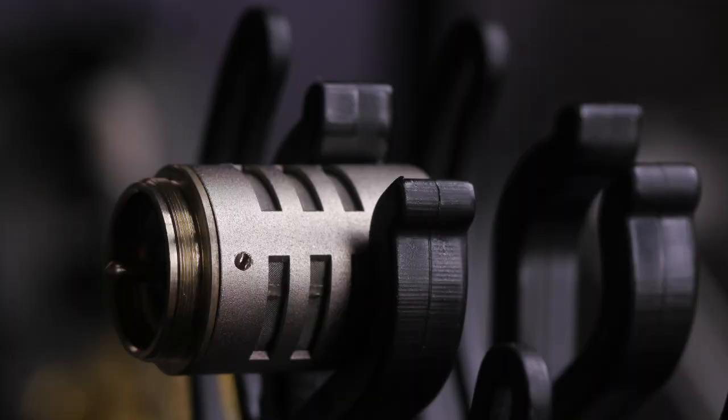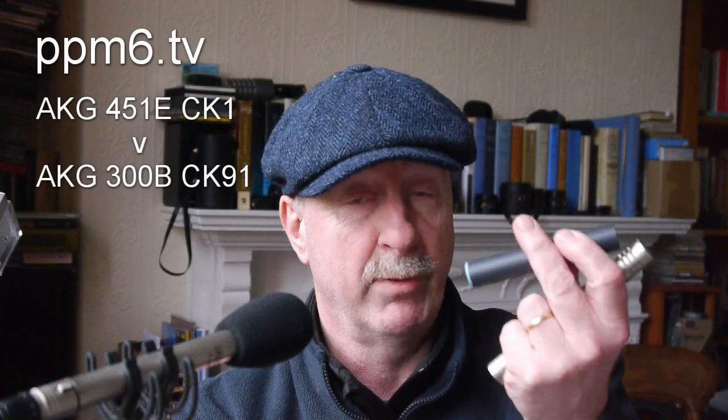The EB's are a little bit newer, and a couple of things to say: apart from the fact there's no bass roll-off in the body — which I've got in the recording system — they have interchangeable capsules. The capsules look a bit like this and they have the world's finest thread. I'm not even going to unscrew this one because it was so easy to cross those threads back in the day. That's why we were very grateful when AKG invented the blue line system — in a way a successor to the 451EB — with a nice bayonet fitting. You could get different capsules; it was a very flexible system.